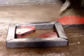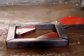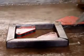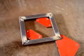Alright, that wasn't very good but it's there. Next corner. It's not good — I haven't welded in a couple days and it's kind of cold out here, so I'll try it again. It doesn't have to be real pretty because we're going to wind up grinding these smooth anyways. As you can see, I now have everything all tack welded up — each corner. I'm not too concerned about the gaps right now because I'm just going to fill them in with weld and grind them all.